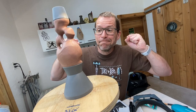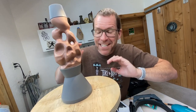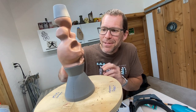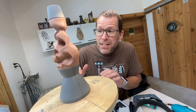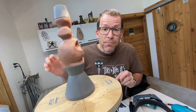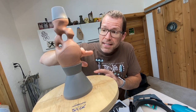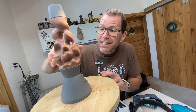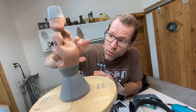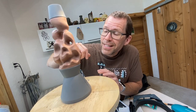Okay, this is it — I'm calling the sculpture done. I'm really happy with this one; it's gonna be super cool. I cannot wait to get the mold on it and start casting these. Could I have gotten it smoother? Probably, but I have to keep in mind that I'm casting these into clay, which is extremely easy to smooth — we smooth out every slip cast and lightly brush it over. And this is all going to be coated with a beautiful satin glaze, which will cover and smooth that surface even more. You can see I've got my score line on the back, which is where the opening will be for putting the straw in.